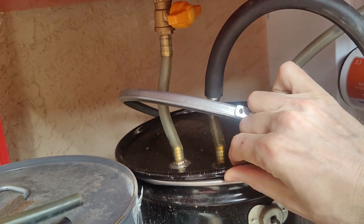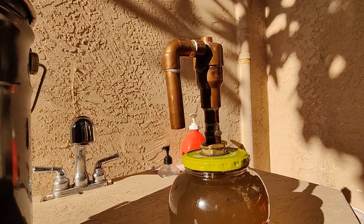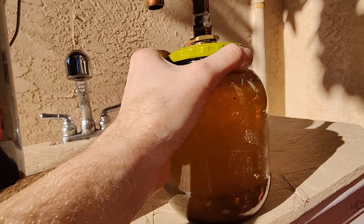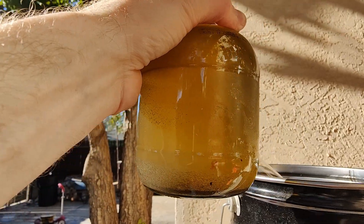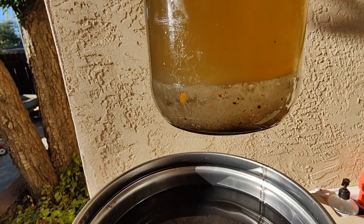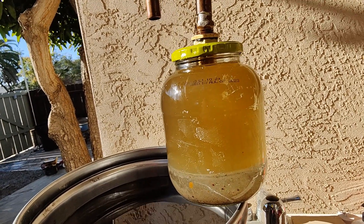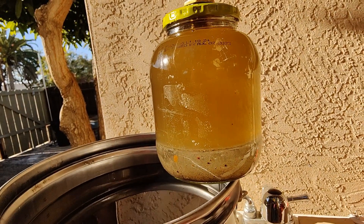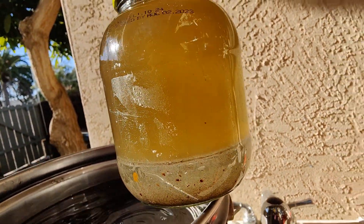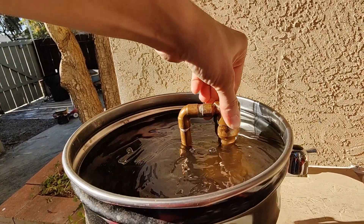Opening up the solvent reservoir on the bottom, we can take a look inside. In the very back you can see a vortex separator that I built for this project. If you're wondering why my solvent is kind of a gross pea color, it's because the dye from the lid of the jar I'm using was dissolved by the solvent. One nice addition to the solvent holding tank and the vortex separator is adding a little bit of water in the bottom — the water allows the dirt to fall down through the solvent and once it hits the water layer it'll separate out. This makes it easier in the future to clean the dirt out: I can just suck out all the solvent until only water remains, then remove the dirty water and dispose of it properly. Once done, you just pop the vortex separator back into the solvent tank like so.